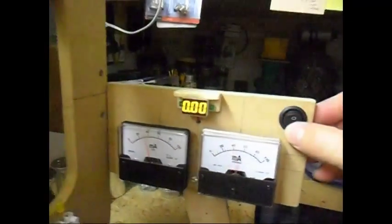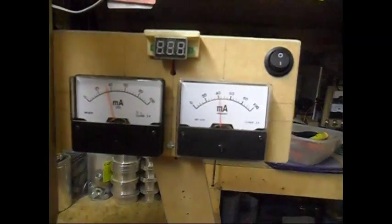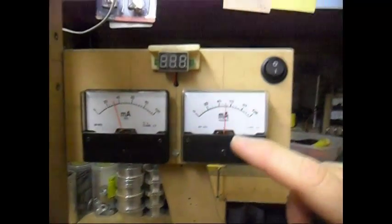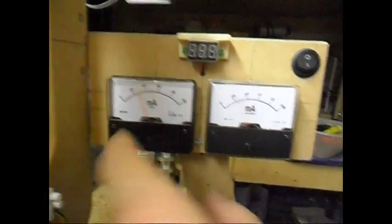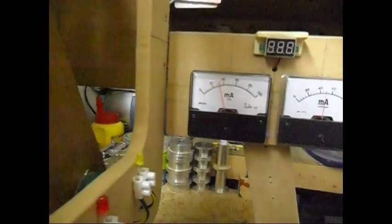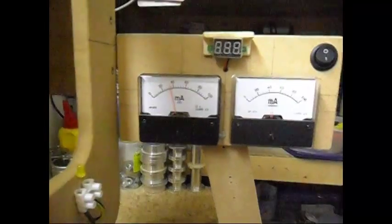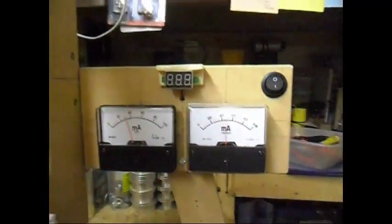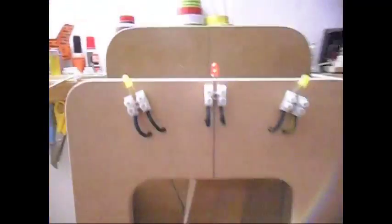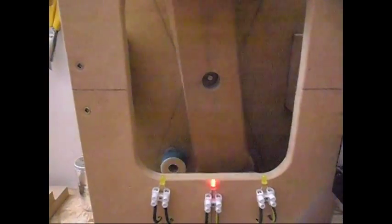Here is the base. Voltage is now 12.7 volts. Here you can see the milliamps input and milliamps back to the source. It is an average of 40 milliamps input, and over there an average of maybe 32 to 33 milliamps back, so it's around 70 to 80% efficiency. And of course the LEDs are lighting up at this speed of the beam swinging around.